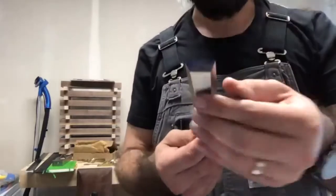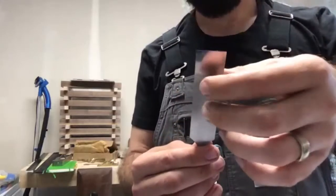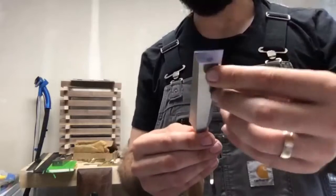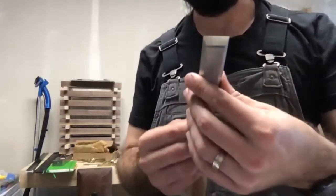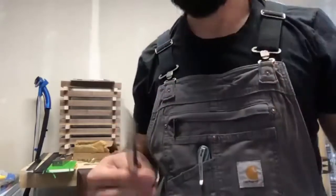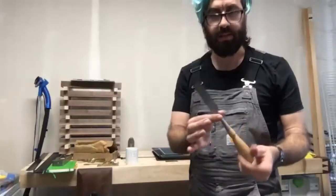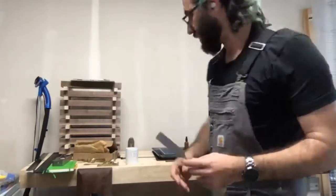And it's pretty close to how it came from the factory. I worked a fair bit to try to sharpen this, and then I also sharpened the entire primary bevel, and it took me forever to do. But because I hadn't polished the back, it did me practically no good. So this is one that is not ready to be in shape yet.